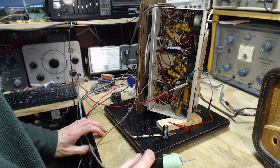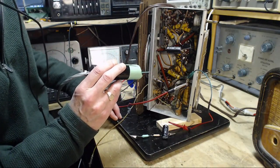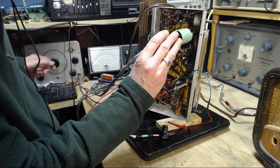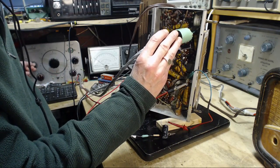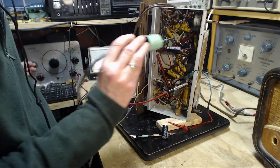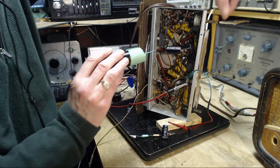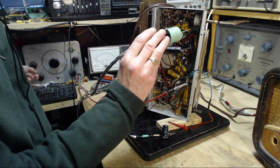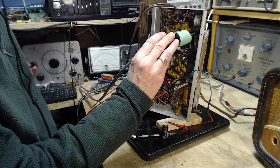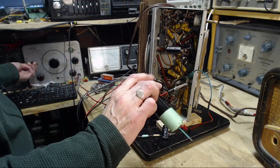And as any one of you is saying, well, just change all those paper capacitors and the hum will go away. You know, it could be the truth. So on the output of the volume control, but it's turned down right now, the input to the volume control, I don't hear the hum there. This is on the output of the volume control here. Oh. Output of the volume control. Yeah, this guy has his own hum.